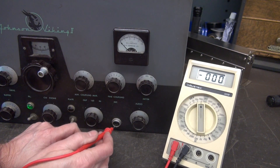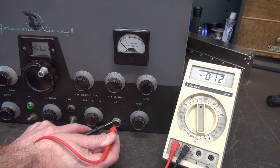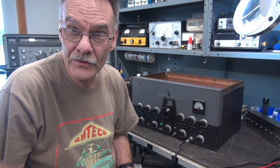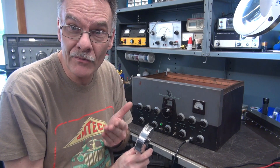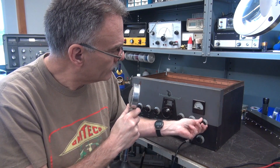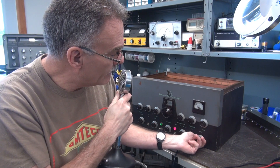Let's verify our voltage now on the microphone jack. Remember we had 400 volts before — now the new push-to-talk relay sees 12 volts, and that's all that's going to go through the contacts on your microphone. It's fully isolated. You're not going to have to worry about 400 volts giving you a punch. The true test: how well does that push-to-talk work? Got my microphone hooked up to the front jack and keyed it up. I've done no audio work on this Johnson 2 yet, but what we're verifying here is just push-to-talk. And it appears as though it's modulating — one, two, three, four. Not too bad either.